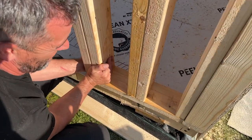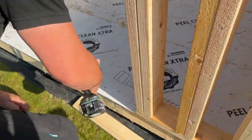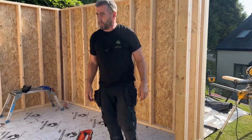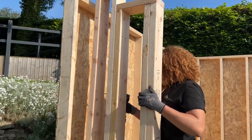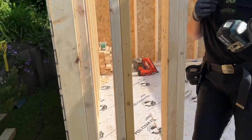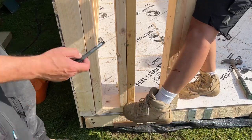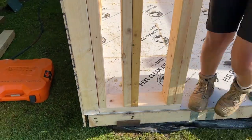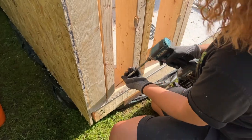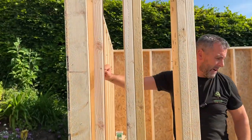I'm not going to screw this side because I need that movement — what John's going to do in a minute is run a string line through to make sure both walls are running through with each other. Jen's wall is up but not secure; there's just one screw in it. What she's going to do is get it flush at the bottom, kick it tight in, and put one screw in the corner so it can still pivot.